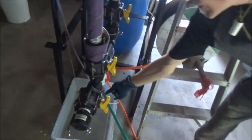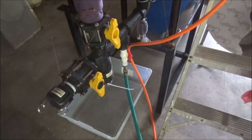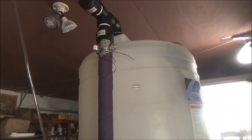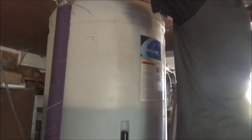Right. And so the pump is, 2 pumps are over there and they're air. Okay. So we're running probably 180 liters per minute of air. And there's just a hose with a hole in it that goes right at the bottom of that quick release valve, or the quick release coupler. Sure. And it carries the liquid and air up to the top, aerates it, and dumps it in. And then if you want to climb up here. Yeah.